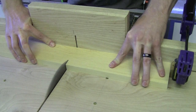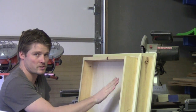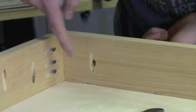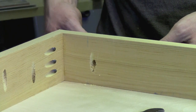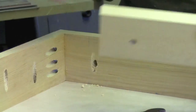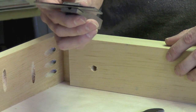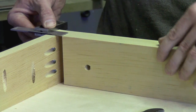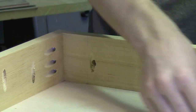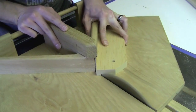There will be a stretcher in between the two legs just to make sure that they don't rack. When the legs are folded up inside this apron assembly, they have to be flush with the surface or below. I've pre-drilled a hole an inch and a half from the actual playing surface up the apron, and about three inches from the back of the apron, which gave me a center point for my through hole for the carriage bolt. The leg is the same thickness as the apron itself so it's nice and flush, and I've got it back-set about an inch and three-eighths from the apron. I drilled through into the leg, the carriage bolt lines up perfectly, and we just need to take some of the corner out so it has room to pivot.